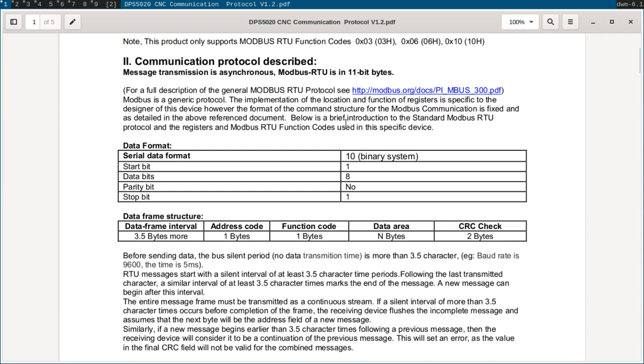Modbus is a serial protocol, very much like what you get on any Arduino. If you've done Arduino programming you do a Serial.print and can send a string from your Arduino to your computer and it'll spit out in the terminal. Likewise you can send characters back and read them on the Arduino, and you've probably written functions parsing that text and know how messy that can get fast. Modbus takes that raw serial communication and adds a layer on top of it specifying the structure those things should follow, making it easier for devices on both ends to communicate. Manufacturers of industrial devices can have something common between them rather than everyone inventing their own standard.